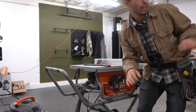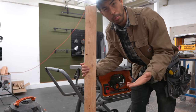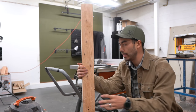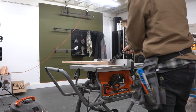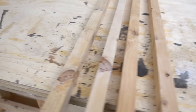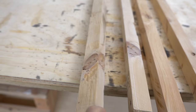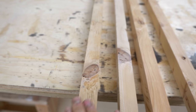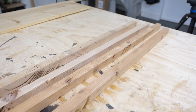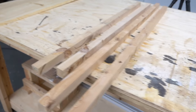For the legs I'm using a 2x4 and I'm gonna rip it in half to make two 2x2s — those will be the legs. I cut one edge and then used that edge to cut the other edge so we have a relatively nice square. These are supposed to be farmhouse style stools so if they're a little bit rough, that's fine. They don't need to be planed down but we've got some good squares to work with now.